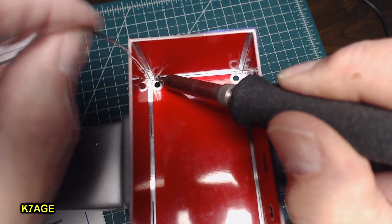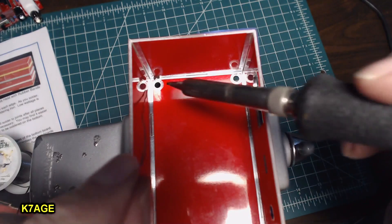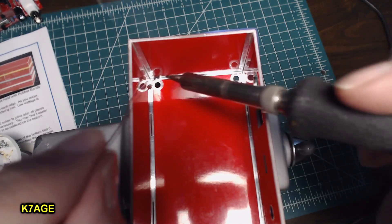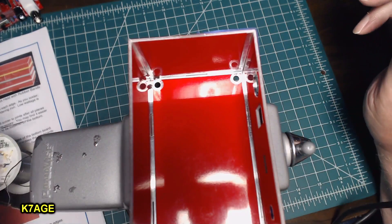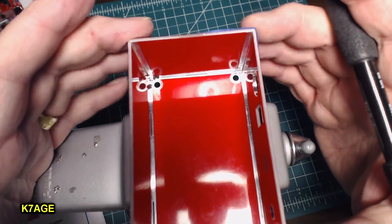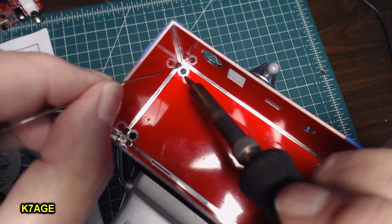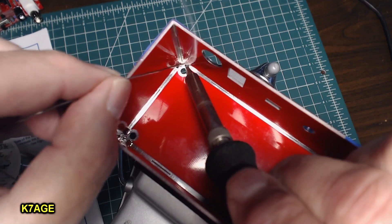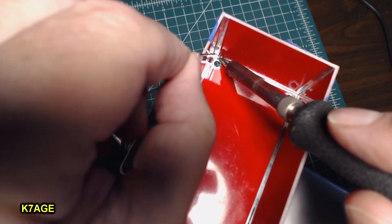I was able to put this in my little vise. That flowed quickly — yeah, that worked nice. I'm going to put a little solder in the three corners here. There it flowed, and on this piece — it bridged across. I think that's going to be okay. Just check the alignment of the edges and make sure everything's lined up. Solder — boom, it flowed. Just put the point right down across both edges and feed the solder. You can see it go across the bridge — it just goes across the joint.